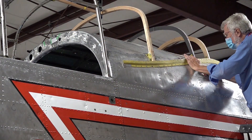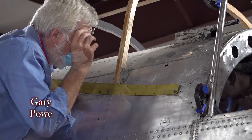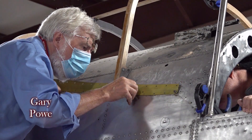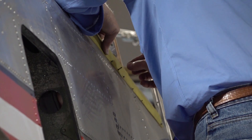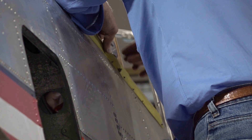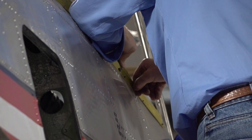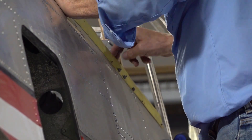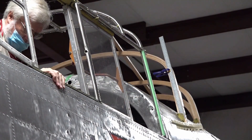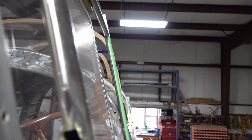Having formed the basic shapes of the wood frames, we then want to establish the exact location of the mount points. The flashing strips attached to the fuselage will join to the lower edges of the acrylic to be installed later, so they now play an important part in locating the wood frame mountings. The frames must allow for the correct clearance between the wood and the flashing. As originally installed on FM104, there is a small misalignment in the canopy from one side to the other. We will accommodate this by making small adjustments on each side in the lower ends of the wood frame shape and mount holes, keeping the flashing strips in their original positions on the fuselage. At the forward end of the wood frame section the flashing ends and the acrylic attaches to the steel forward section, with the drawings showing the steel and wood frames parallel in this area.